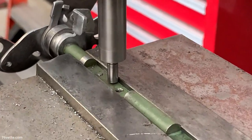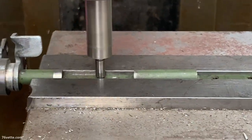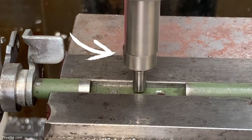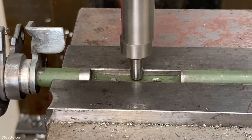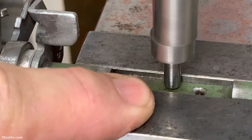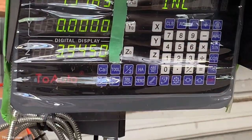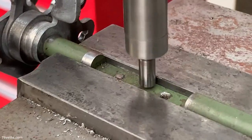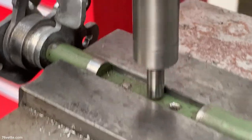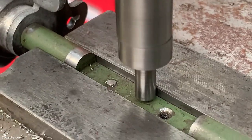I'm cranking back to that back edge — you might want to come straight on because you'll see this thing shift over sideways when I touch that edge, and I know that's zero. See how it moved over? So I know I just touched that edge. That diameter is 200 thousandths. This is X travel, this is Y travel, and this is Z travel, so I'm going to zero. I'll come back over and touch a couple times just to make sure I didn't go too far — I'll crank it in real slow this time.